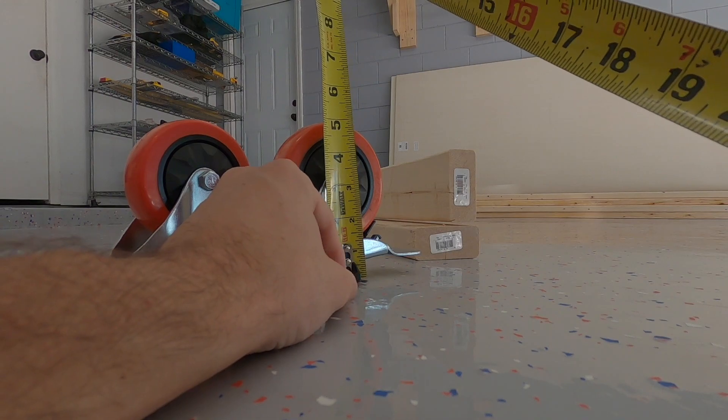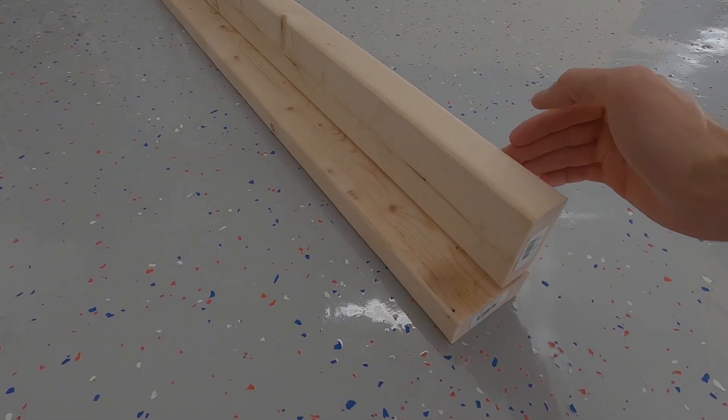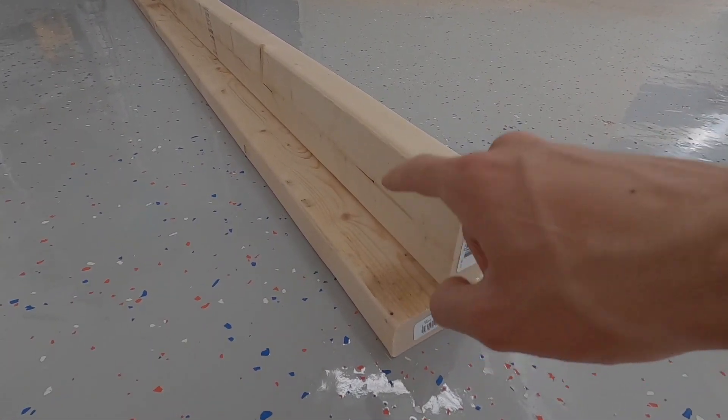The wheels were just about five and an eighth inches, but this shot makes them look just under five. I'm also going to be cutting a five inch piece to put on the bottom of all four legs. That way, instead of screwing into end grain, I'll be screwing into the edge grain. It's a lot stronger that way.